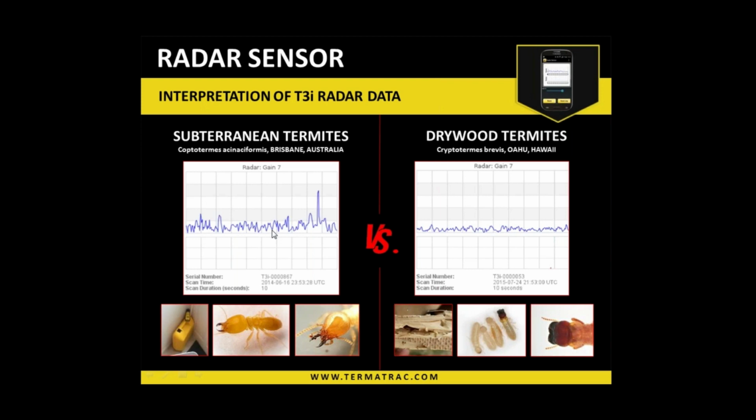So a few other things that I do to help with determination is manipulate the area or manipulate the termites themselves. With that, it's just a matter of tapping around the area to trigger a response from termites. Termites are very shy, quite a defenseless creature, so they do operate on picking up any clues or cues from outside of their immediate colony members. So they are a very soft-footed creature. They're susceptible to picking up vibrations which aren't theirs or from the colony members. And with that in itself, we can utilize that against them.